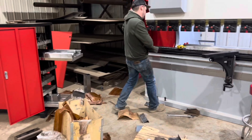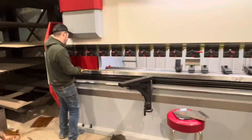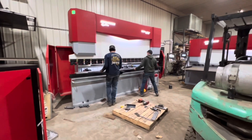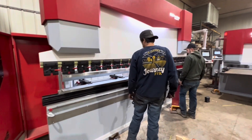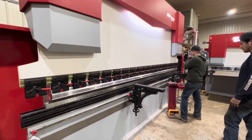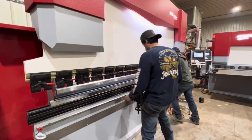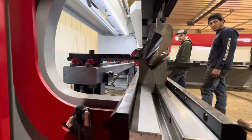You'll notice when trying different materials, the bend can look open or closed right away — that's just part of owning a press brake. Right beside the angle input in the controller, there's a spot for correction on the left and right side. It's very common whether you have a press brake like this or a $500,000 ATC Mitsubishi — they all work off a target angle plus a correction, because different parts of the world, different parts of the country, material thickness, mill scale thickness, condition of the machine, temperature of the hydraulic fluid, ambient temperature in the shop — they're all factors. So you have to dial in the bend to get it perfected. It's super easy to do.